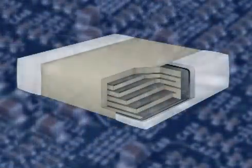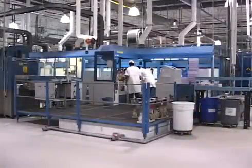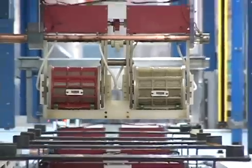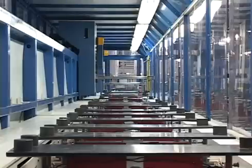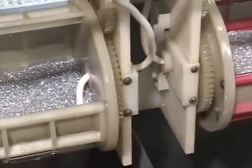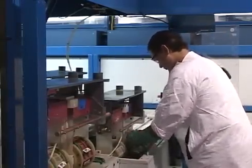The terminated chips are then electroplated with a nickel barrier layer, followed by an electroplated tin layer. Chips are plated using either an automatic barrel plating process or a rotary flow-through plater. The automatic barrel plating line is a continuous operation, which is computer controlled and capable of processing a variety of chip sizes simultaneously. Chips are loaded into plating barrels with conductive media and plated in the auto line. After plating, the chips and media are removed, dried, and separated.